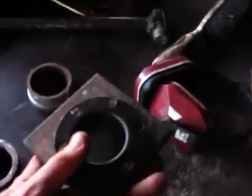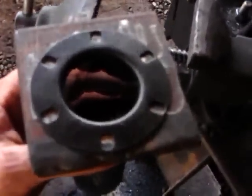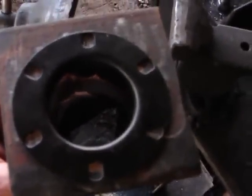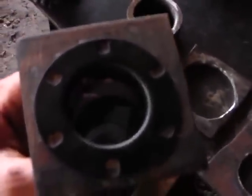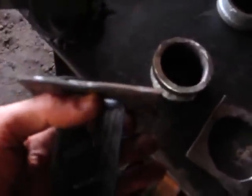Now, the idea of this is to bolt that down onto there, so I'm going to mark the holes and tap the holes out with a thread tap, and then screw this straight into the metal. After the precision machining, let's see if we can see. You can see the holes here that are drilled out after marking, and now I'm tapping them with this tap set